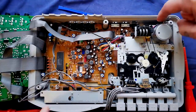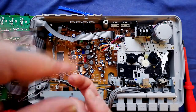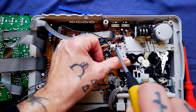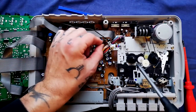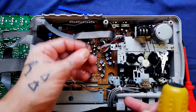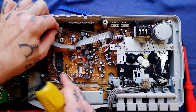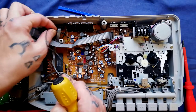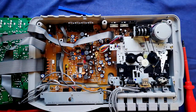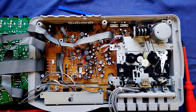I'm about to remove three screws — that fourth one isn't in, I've already put a cross through it, because that is another one of these sandwich joints where the two halves of the plastic case join. I've put a marking to remind myself that all these common ground connectors converge in this corner: one going to the playback record head, one going onto this board, and one joining to another. It looks like there are two connectors to this board, meaning the two parts of the circuit board are electrically isolated, and the chassis of this transport acts as a junction for all the common ground connections.